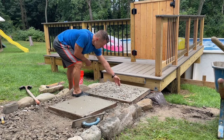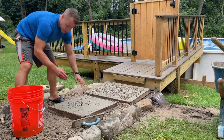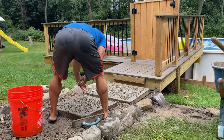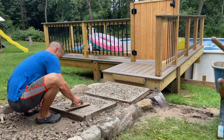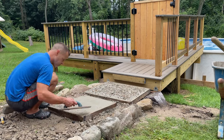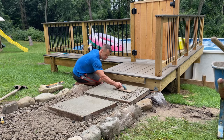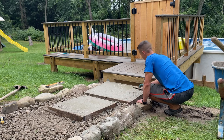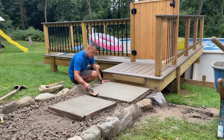Once the concrete is leveled off in the forms, we can put pea gravel on top. I'm just sprinkling it however I choose — you can be as creative or as uncreative as you want. Then we're going to take our float and gently push the pea gravel down into the cement. You don't want to work it too much. If you're doing a patio or walk, one of the hardest things is to not keep working the cement because you don't want to push the decorative pebbles down. If you work it too much, when you go to wash off the top, all your pretty pebbles are going to be too far down.